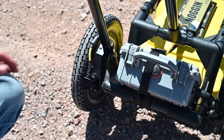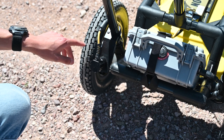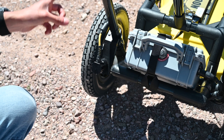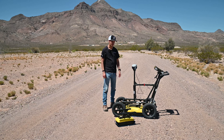As it's moving, there's an odometer wheel down at the bottom that turns with the back left wheel — that is actually what's measuring the distance it's traveling. It's very important that that's still working, because if it's jammed or not touching the back wheel, it's not going to update how far the unit has traveled.